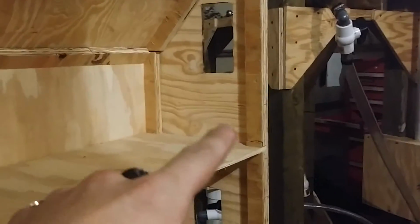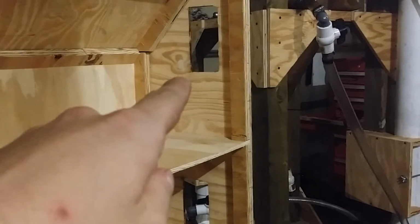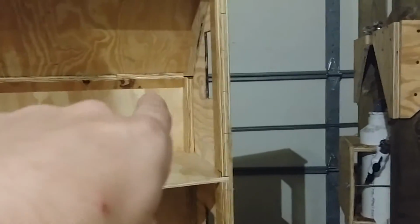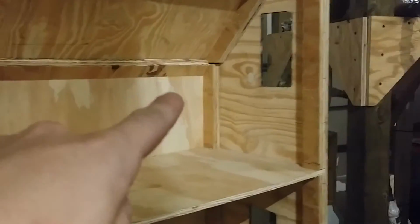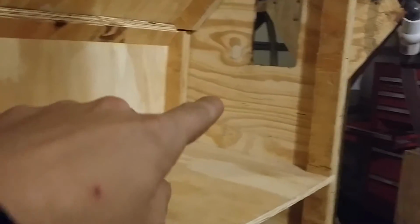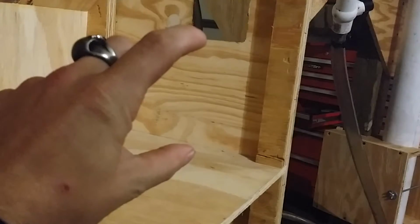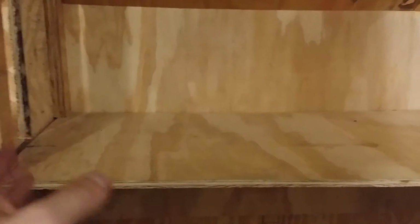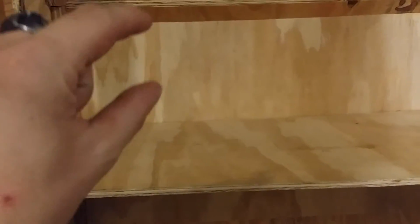So we're back to don't put the windows in until the end. It's probably going to help me out. I've got a laser level now, a rotary laser level. I'll probably set it between this window and this window, and then I can mark out where all of the other windows need to go. If I didn't have a cool rotary laser that I got from Harbor Freight for like $60, pretty cheap, pretty awesome, I would just measure this distance from the floor up to there. But again, if you have a saggy floor, your windows are going to be all off. It's not going to look right. So make sure your floor is nice and straight. If you're doing it that way, measure it off the bottom, draw a line, mark off your windows where you want them. So I'm going to put those in.